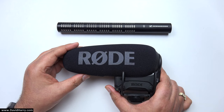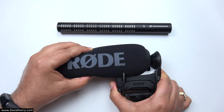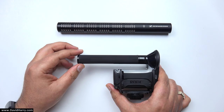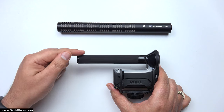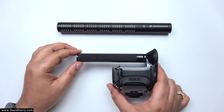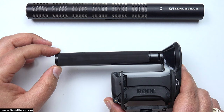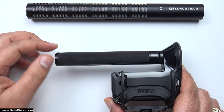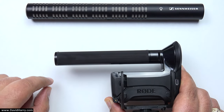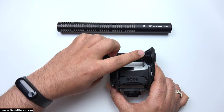The third example of a shotgun microphone is the Rode VideoMic Pro Plus. Let me just remove its foam filter. We can clearly see here another interference tube. What may not be so clear is how the interference tube is working, because this one has a very fine mesh surrounding it — I'm assuming that's just to stop debris from entering the tube itself. The design on this one is slightly different: it uses two symmetrically tapered ports, effectively one port all the way down one side and another all the way down the other side, tapering from the front to the back. Nonetheless, that is an interference tube, and the capsule is placed at the base of the tube.